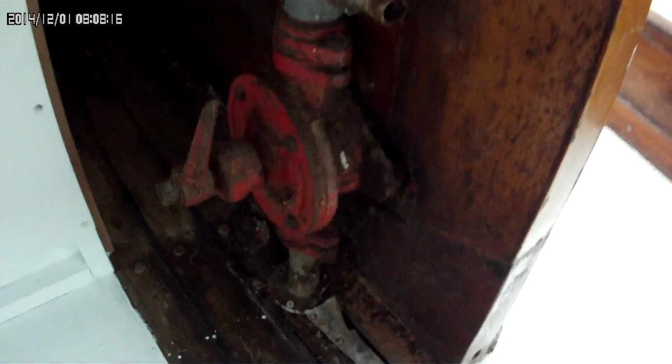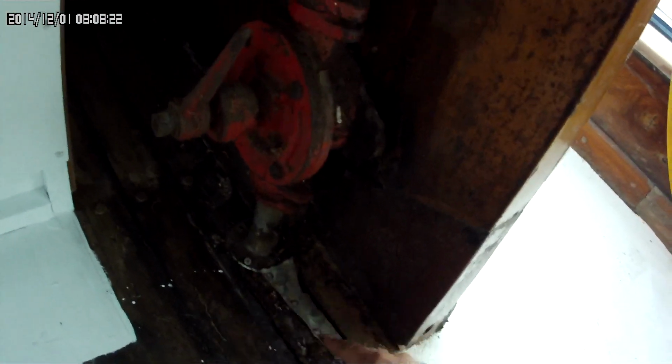But that's there. I've started the framework on this, and while doing that, there was fiberglass over the top of this area. Rather than putting in some Sikaflex and making it work good, they fiberglassed it, and they've got some brass plate here with some black brass nails. I've got to replace some wood that's in here. That's not a problem to chisel it in. I've got a main beam that's here, and I'll replace that, and I'll clean this up, and that'll be good.